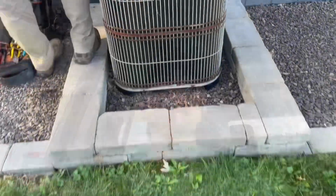All right, so today we're installing a 2.5 ton carrier system at a really nice house next to a church. Really nice couple. I really appreciate jobs like this because sometimes you get those nasty houses. Check a couple of my old videos out, you'll know what I'm talking about. But today we had a really good install, went really well. Proper procedures all the way around, braze with nitrogen, pull down a good vacuum, decay test, blah, blah, blah. You name it. Just stay tuned.